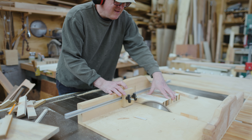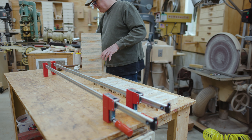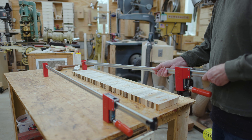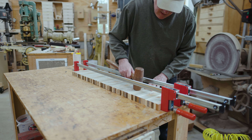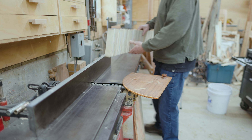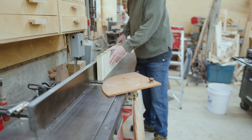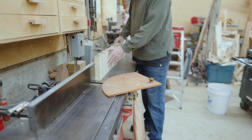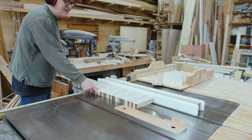As they had dried, they didn't quite fit perfectly flat to each other. So I trimmed up the ends on the sections I'd started, then glued those sections together into one long piece. Since the side was actually side grain, I could run it through the jointer and get a nice straight edge, which allowed me to cut the other edge on the table saw.